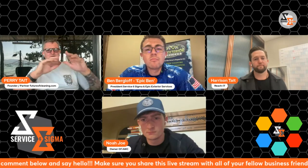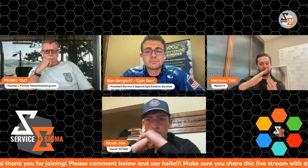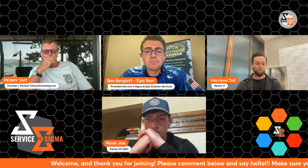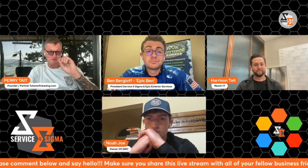It stops the light from bouncing off the glass. Yeah. The idea is the light should go and hit the wafer, the black thing, right? The light should go into the wafer so it can convert to electricity. I'm just trying to dumb it down because I'm the simple one here. But if the glass on the outside is reflecting the sun from going into the wafer, then that sun's not being converted into electricity. So the ARC increases the solar gain, but like any window tinting, it can be damaged quite easily. Yeah, and it's not a plastic, it's a nano coating, so it's very, very thin.